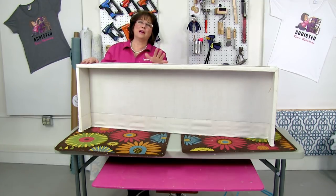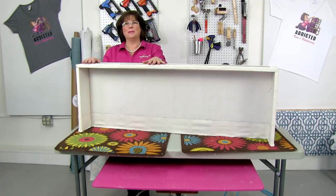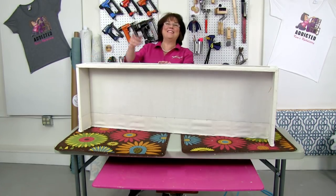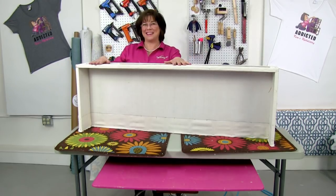The return is the distance it projects away from the wall. The legs are also made out of one-by-sixes — these are called your legs, and this is called your cap. The front of our cornice board is made out of half-inch plywood. You can use quarter-inch plywood, but I wouldn't suggest going heavier than half-inch because of the weight when hanging them. It's always a good idea to have somebody who knows what they're doing hang cornice boards for you, because you don't want these things coming down — especially over your bed in the middle of the night.